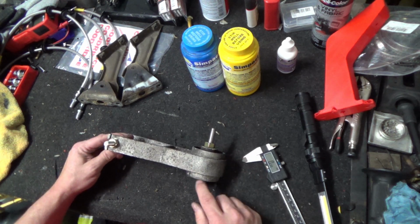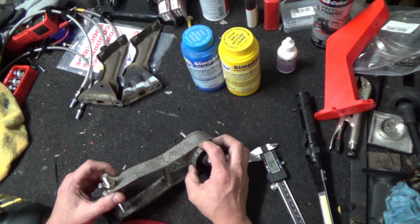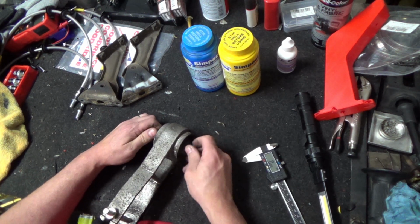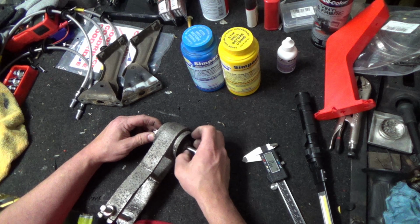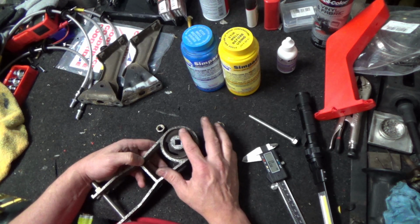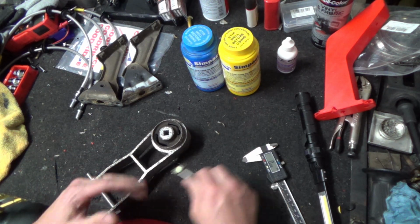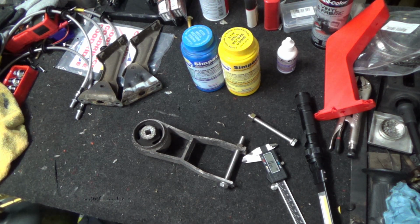Because we need a support. I'll just design it to fit around here, and with the depth, I can actually make the plate into it. I can make this a stepped cavity that I just set the thing in, and I can come back and trim it off. This will be a pocket, so whatever leaks out will come around. I can just cut it off. I think I'm gonna do that. We take some measurements on this, I'll draw that up and print it, and then we'll come back and see how it fits in it.